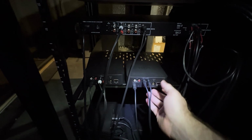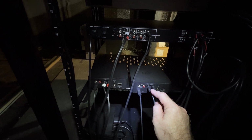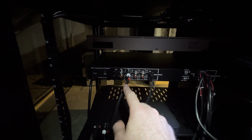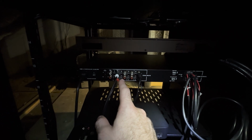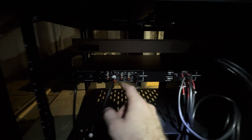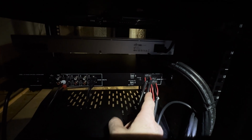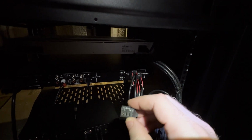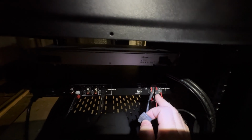The Wiim has a number of different options for this. So you've got your line out, which is 2 RCA cables, and on your amp, you can see the zone inputs here. So the 4-zone amplifier, I am combining and bridging the different zones together. So here is where your outputs are for the speakers, and I've got 14 gauge running in here. They all run into these little things, and then you plug these into the amp itself. So I have this empty bay number 2 right here, which this will go into in the future, and that will be for the patio.